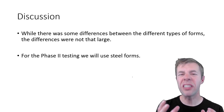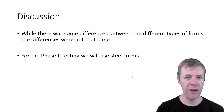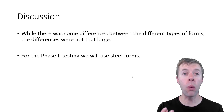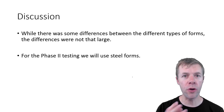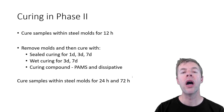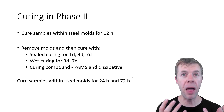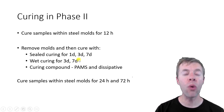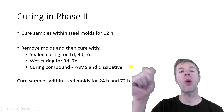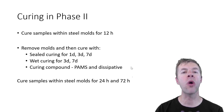While there were some differences, there aren't huge differences between the types of forms, so I wouldn't require everyone to use wood forms — let them use whatever forms they want. For phase two, we're going to use steel forms since they're somewhat in the middle and widely used. After curing for 12 hours we'll try to extend the curing using different methods — putting plastic on the outside, wet curing with burlap, or spraying a curing compound. We'll also still do the same curing in molds for 24 and 72 hours and compare everything.